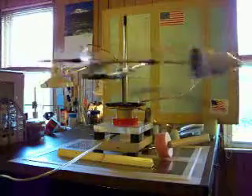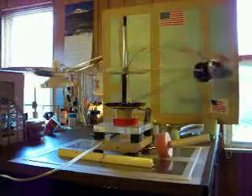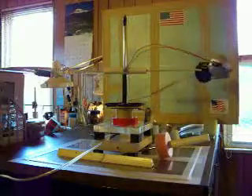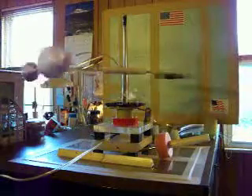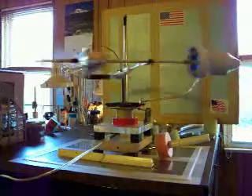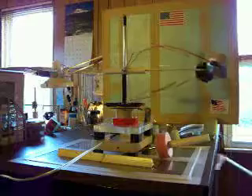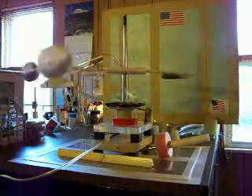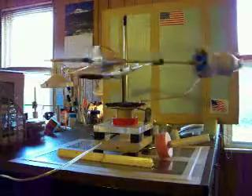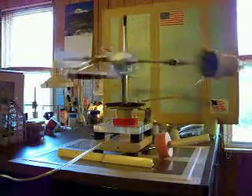Like I said, especially with this new rotating system — when you build something new you have a lot of ideas and you try to improve it, and sometimes it goes the opposite way. So I'm sorting out between what didn't work so good and what I like. The only reason I went to this design is because I wanted a larger diameter commutator so I could use less insulation and reduce the spark-over hazard to the ground, which is the center axle — the part of the grounding system. It's earth grounded.